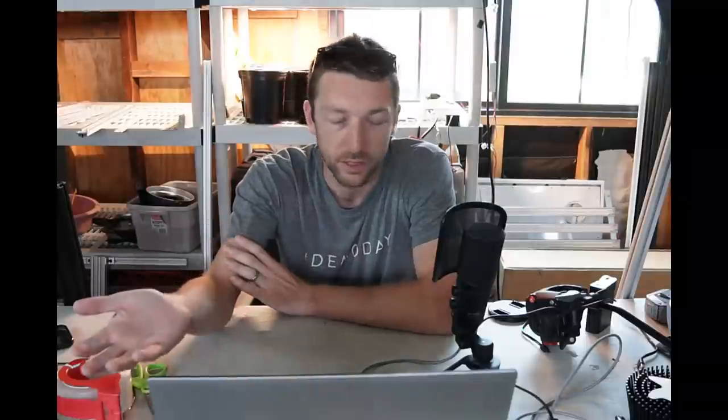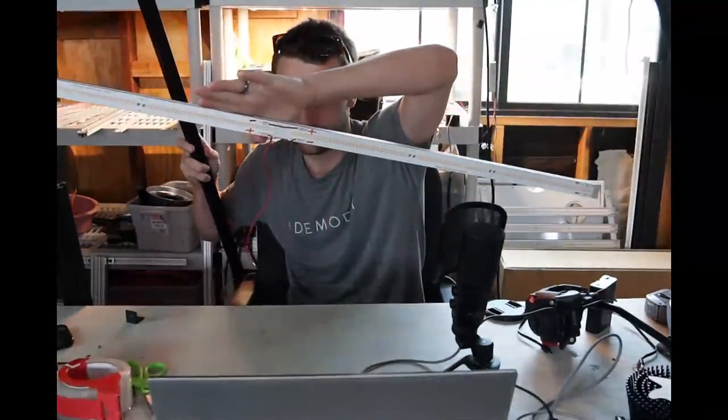If you're looking at the new PLC parts list asking 'what are these corner brackets for, what are these profiles he's saying to use as heat sinks — those don't look like heat sinks' — yes they are, guys. These 10-series extrusions, whether in black or silver, with the flat side will fit two boards. You can go back to the last video to see how to wire in series-parallel. They cool better, they're cheaper, they're easily accessible, and much easier to work with when building your frames. Go to pacificlightconcepts.com — the PLC heat sink page says these have been discontinued but shows the perfect alternative with some FLIR data.